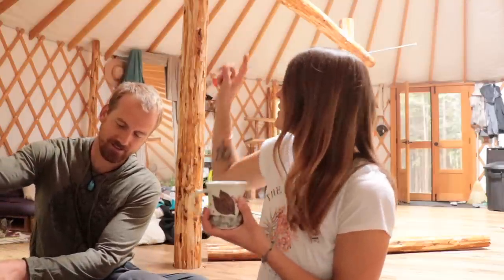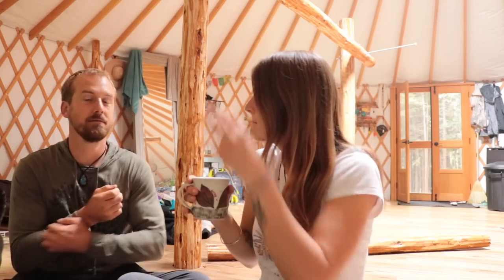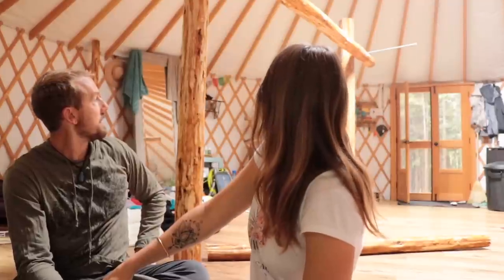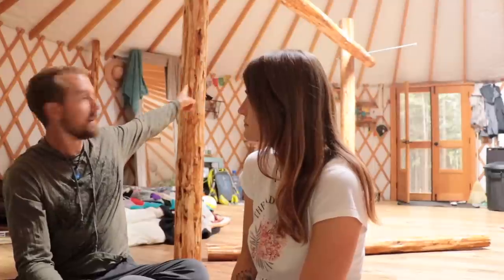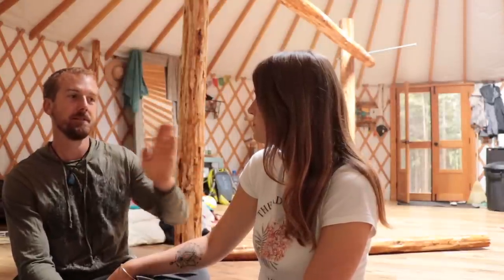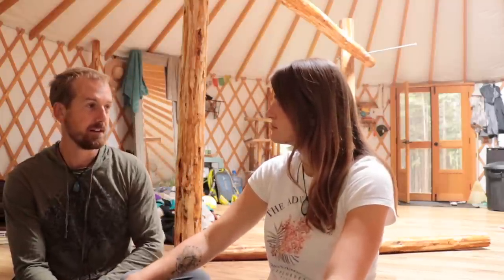Today's plan is just to get more of the cross bracing in. So I'm gonna take a hacksaw and hacksaw off this threaded rebar, and then we're gonna nut it. And then I'm gonna put the horizontal posts on the other rooted vertical posts. So it's like a little corral. And then I'm gonna start putting all the cross beams. So the beams that go across, I'm gonna put them 16 inches apart, so it's very solid.